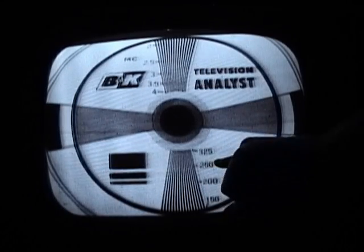Or down here they show you the number of lines of resolution. 150, 200, 250, 325. When I use my B&K, I've also got to take into consideration the fact that I have not overhauled it yet, so I don't know really. It's not exactly perfect itself, but it produces a decent enough test pattern for this kind of stuff. Vertical height and linearity are off just a tad, so I'll tweak those, but otherwise I think those type of adjustments are pretty good. So really I just want to figure out or try to reduce these stripes and get rid of that weird feedback that I hear creeping in occasionally.